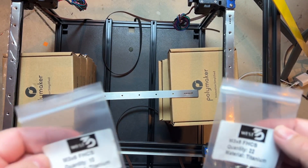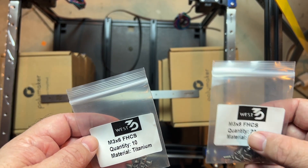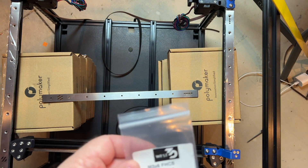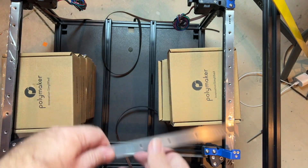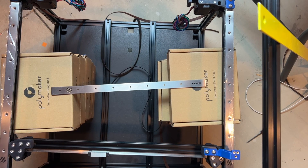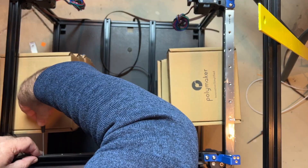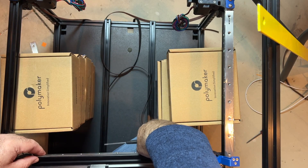To install these you're going to need titanium screws. The 22 titanium M3x8 screws are going to be used on the side rails — the Y — and then the 10 M3x6 screws are going to be used on the X, because the X backer is a little bit thinner so you don't need the M3x8 for that one. Before you install, make sure you have the recessed side where the flathead screw can sit flush, then put the first one in and the rest should be pretty easy.